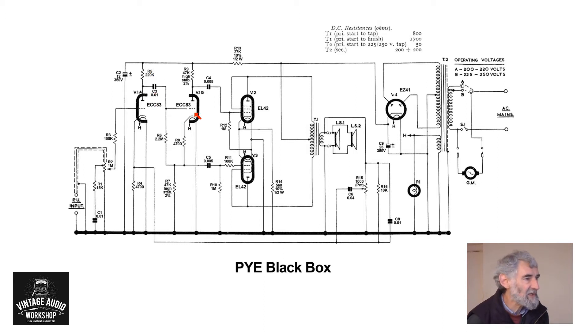It then feeds to the phase splitter — a very simple split-load phase splitter. The resistors in the anode and cathode are the same value, and note that they are both marked two percent tolerance. They're high-stability resistors — probably the only two resistors you'll find in it that haven't changed value. You've got the antiphase drive going through very small 0.005µF or 5000pF capacitors — there will be a certain amount of bass roll-off there, probably to keep the amplifier stable from motorboating at low frequency. Grid leaks as I've pointed out, triode-connected output valves sharing a single bias resistor, which isn't very desirable, but it isn't bypassed. If they are working in proper push-pull, there won't be any signal voltage generated there, because as one valve increases its current the other decreases it and they cancel out.